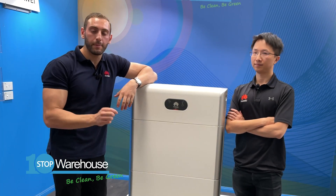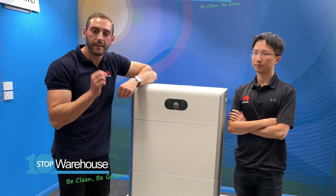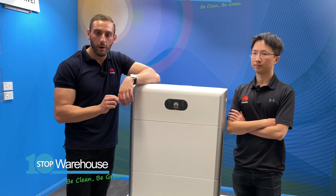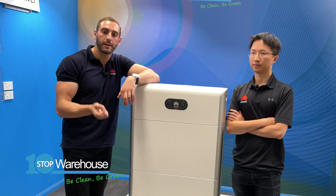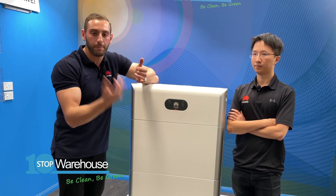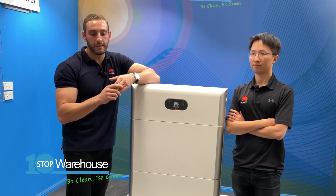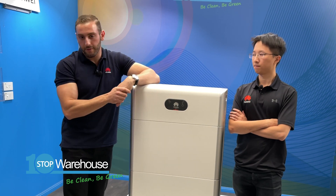The next point is about the significance of the Luna battery release. This Luna battery is the catalyst for unleashing the full potential of Huawei's residential inverter range — the L1 and M1. As you know, they've been sold in the market with an extra battery port that's never been utilized unless going for the LG Chem option. Now the Luna battery opens up backup box capabilities, extra storage and flexibility, and the built-in optimizer per battery module gives the flexibility to expand or mix different-aged battery modules.